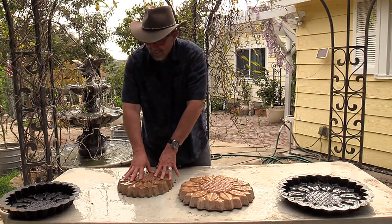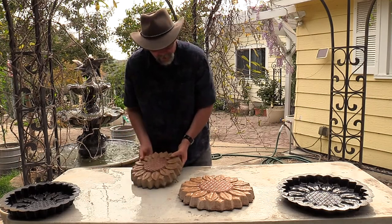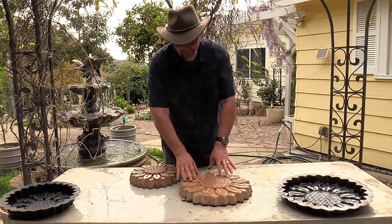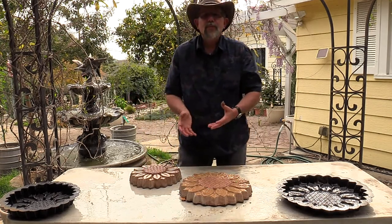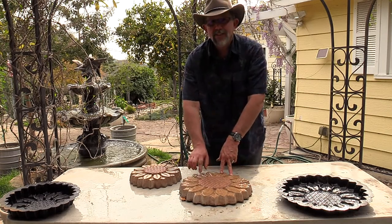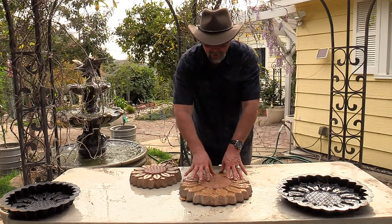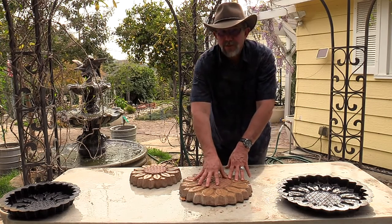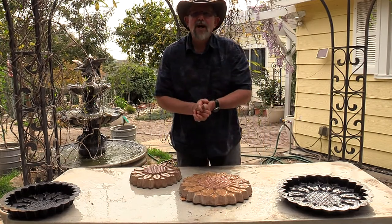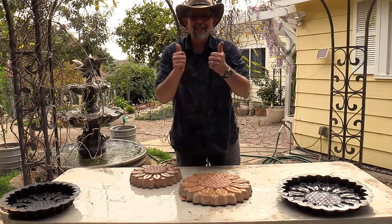I just took these out of the mold — very easy to do. I rinsed them to get some of the dust off. You can see you've got your brown and your buff both looking really good. The colors are nice, subtle and pronounced. The buff has enough yellow in it that we get the symbolism behind it. Just a reminder: Quikrete 5000 is excellent for casting these. In three weeks this will handle 5,000 PSI — you can ride a bicycle over it. Right now it's probably at about 1,500 to 2,000 PSI and it's going to quickly accelerate to 5,000. Thanks for watching, and to my new subscribers — I appreciate you subscribing. Have a great day!